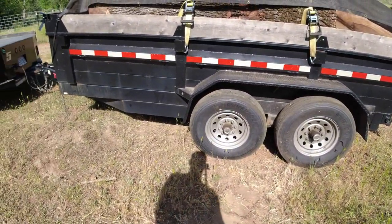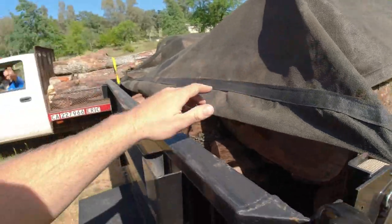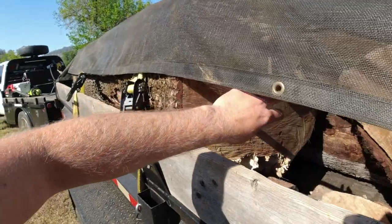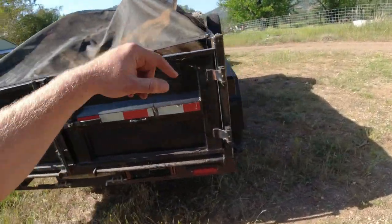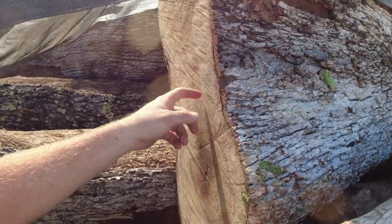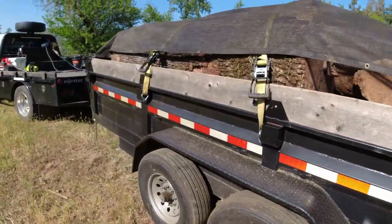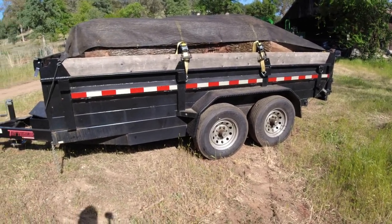The tires are handling that load a lot better than those old ones, that's for sure. I'm gonna ballpark around 10,000 pounds. This big log here was tipping the 080 out at full stretch, and I can almost get full stretch lifting one of those big retaining wall blocks — those weigh like three to four thousand pounds — so that weighs about that. Got two of them in here and then a bunch of little guys in the bottom. This stuff is like petrified hard oak, it's heavy. For a 14k trailer it's right in the threshold of what you want to be hauling. With those spongy tires it didn't really care for it too much, but with good tongue weight I think you can handle it just fine.